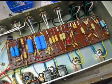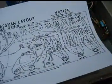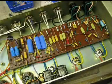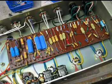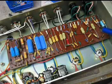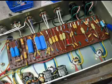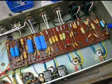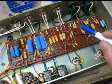What's interesting about this amp is it actually follows, once again referring to our Tweed Bassman layout and schematic, this schematic very, very closely. Some interesting things to point out, because it is a bass amp, a PA amp. It's the closest circuit that Marshall released to the early Bassman. You have the same shared biasing setup for the first preamp tube as the bass amp, the same type of coupling caps you see in the Bassman.